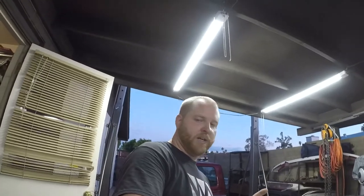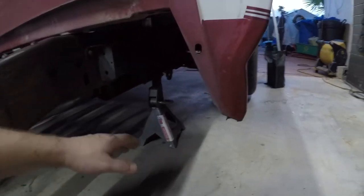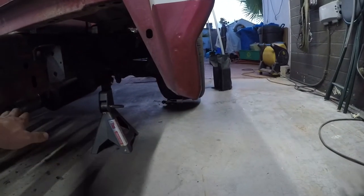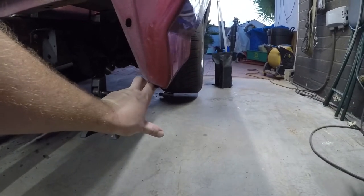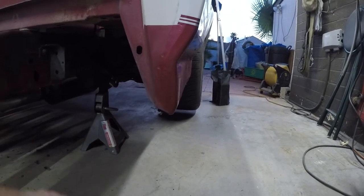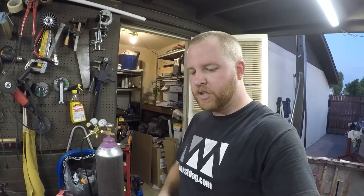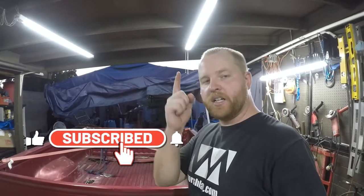Talking about side pipes - originally I wanted to come right out here but I can't, because this line is just barely below the frame. To bring a three-inch pipe out, it would have been half in, half out. That costs ground clearance on the lead-up to the tire. It would have been a disaster to make it sneak under the frame, and I couldn't come over the frame like a lot of guys do - the frame rail is just right in the way and the bedside doesn't come down far enough. So that's why we did an axle dump. Thanks again for joining, I'm Sean - see you next time.